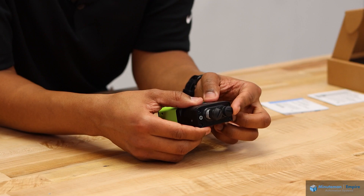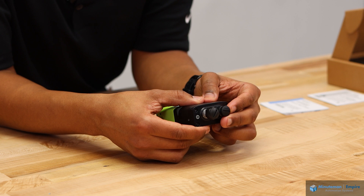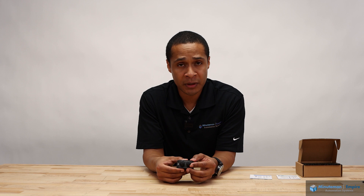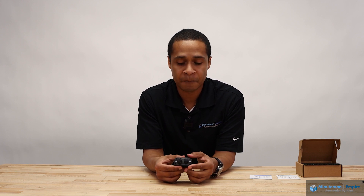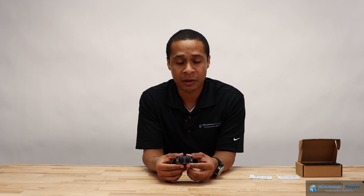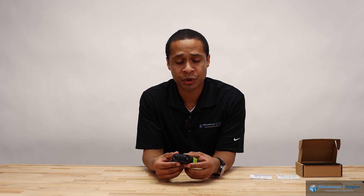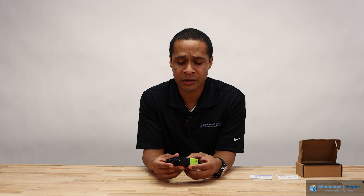On the other side with the Ethernet port, we support PoE — Power over Ethernet Class 1 — and several protocols. So we can talk Profinet, Ethernet IP, Modbus TCP, TCP/IP, and there are other field buses coming out in the near future. This port can support up to one gigabit of data transfer, so for larger image transfer, you're able to handle that through that same port.